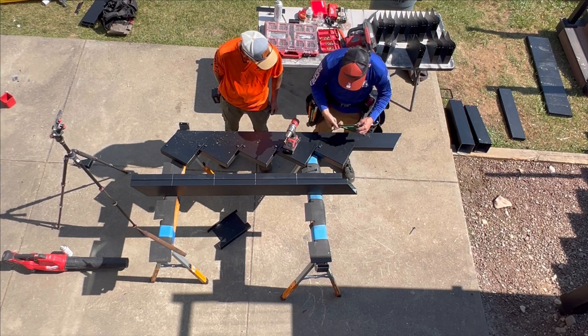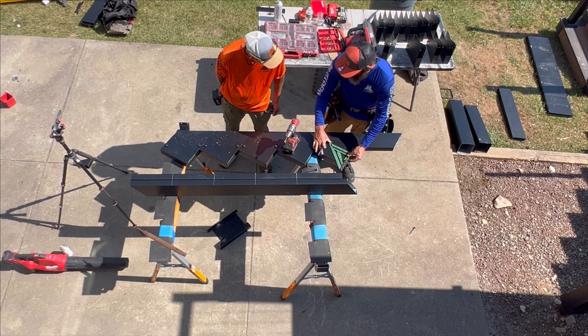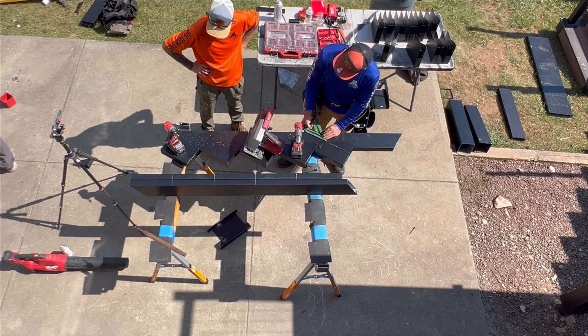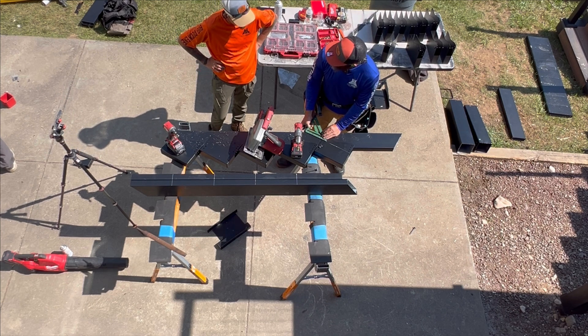That's why we measure to the decking on the surface — because that adds the inch, and then we take it off the bottom, which moves everything down so it's all consistent rises. We'll mark that: 6 and 1/8, 5 and 1/8. This decking's only 7/8 technically, so we'll take a little bit less off.